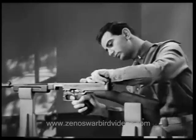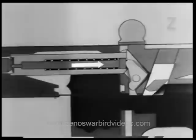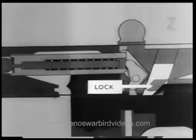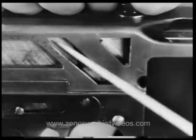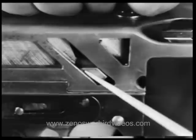This brings us to the third and last phase of the firing cycle — the rearward movement of the recoiling parts. When the cartridge is fired, its fast-burning powder produces maximum chamber pressure almost instantaneously. This pressure drives the bolt back. The bolt in turn forces the lock back against the locking surfaces of the receiver. Notice the angle of the locking grooves — you can see how the rearward pressure of the powder gases forces the lock back against these grooves. That's how the bolt is locked in the forward position.